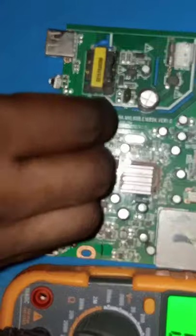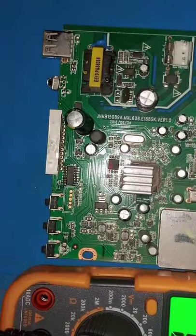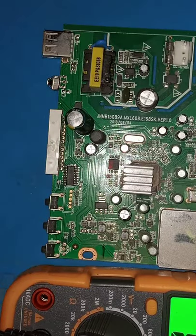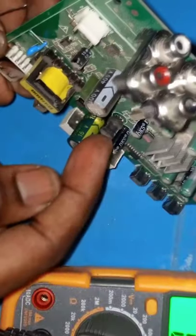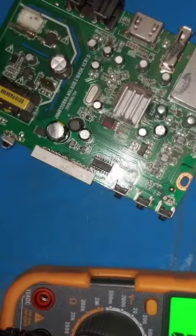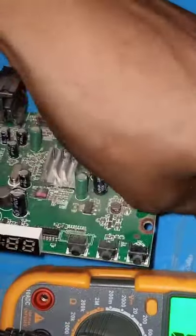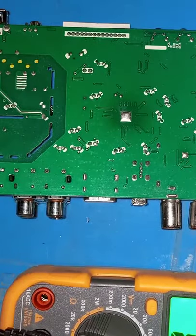Let me turn on my hot air gun to take out the capacitor. Before you remove the capacitor, make sure you know the polarity, because this is a polarized capacitor. The shaded portion is the negative side. You need to know how you took it off, or you can read the printed wiring on the board to find out the polarities. This capacitor is no good, so let's put it aside and take it out.